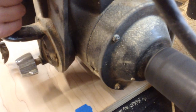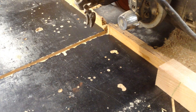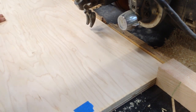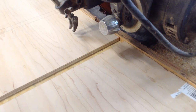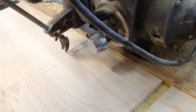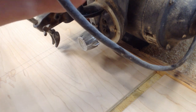Once I had all that spacing, I took my two panels to the radial arm saw, put a dado stack in, and cut out my grooves. I prefer to do any sort of perpendicular joinery with dados and rabbets - it just makes for a much sturdier finished product. It's really important that as I transport and reinstall this piece, it stays exactly the way it is, or all the reveals on my drawers will be off. Using a stop ensures both panels are the same so the horizontal pieces line up perfectly.